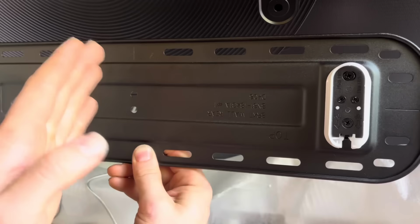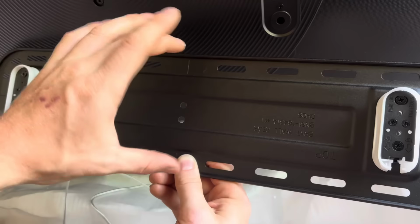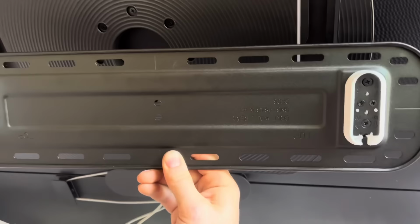And if you just have a center stud, you'll mount it here and then we'll use some Hilti toggles, which are good for 200 pounds. And you could probably just even do one here and one over here. This center stud should be more than enough. These are just going to keep it from trying to rotate ever. Now that we have all those measurements though, like I said, this is the most important measurement.